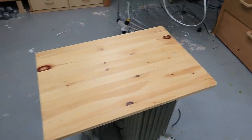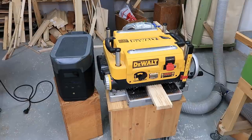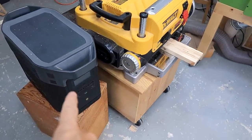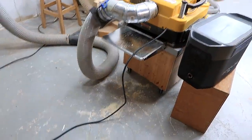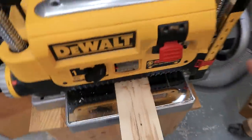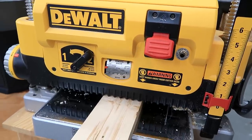This piece of shelving is supposed to be the top. I cut the legs from pieces of 2x4 and then planed them. But my planer was still in a bad state — I'd previously cranked it down hard on the wood so the indicator needle was up. Without thinking I went to plug it in, but the planer was switched on and actually stalled hard on a piece of wood, so it just hummed and there was a huge spark at the plug. I unplugged it immediately and fortunately nothing was damaged.